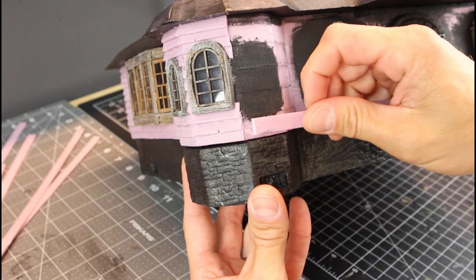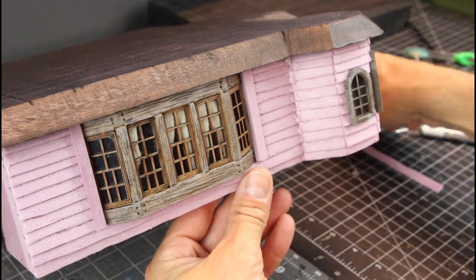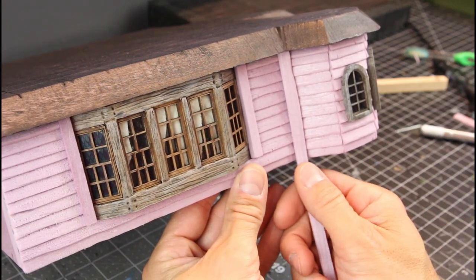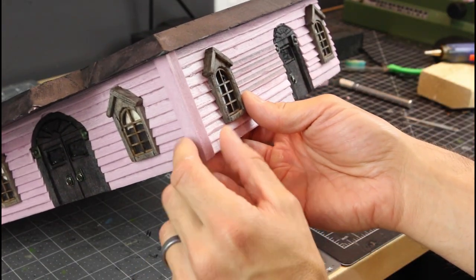And the way we install these or put them on, place your first section on and then just overlap it by maybe an eighth of an inch. To cover up where they meet, we'll put a couple straight strips, a couple J channels around the window, and a couple angle pieces like this to cover the corners.